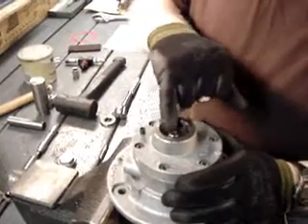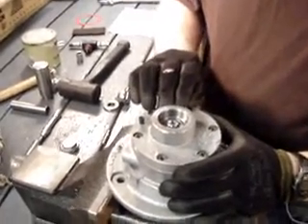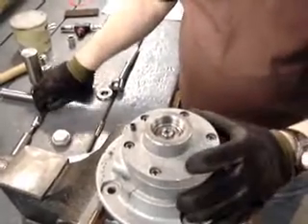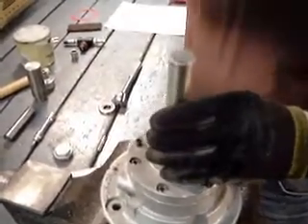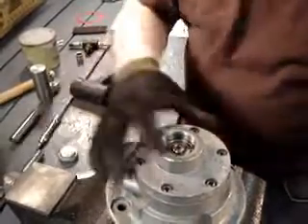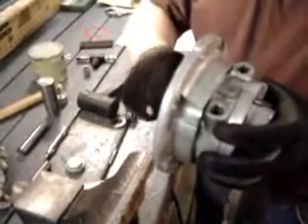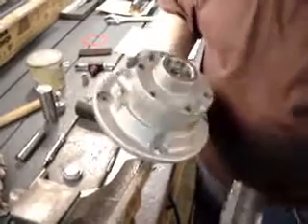On the top here, you can see the rotor assembly is just sticking out maybe about an eighth of an inch. You can go right about that point and stop — sometimes you can go just a little bit more. It's not necessary to have this bearing bottom out; sometimes it'll get too tight if that happens. I can still turn this, so we're looking good so far.